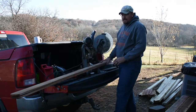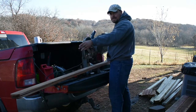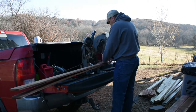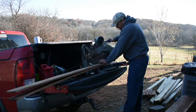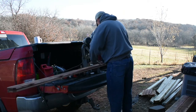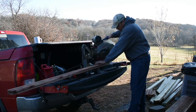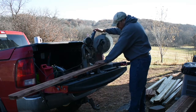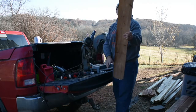So what I'm gonna do is, I got the full pickets. I've matched up the ends. That end has the dog ears on it. So I'm gonna cut new dog ears on this side. One inch. And I like to do it 2 boards at a time. Now I have dog ears on both ends.